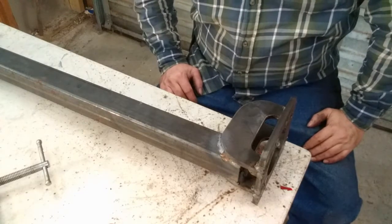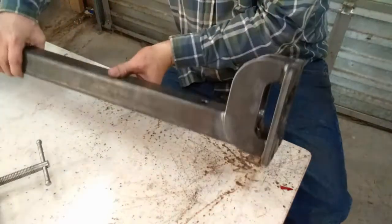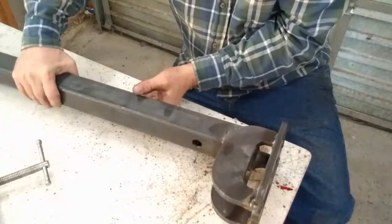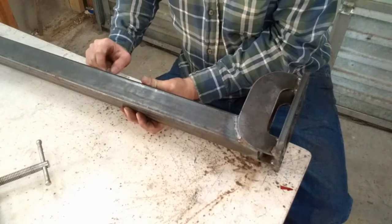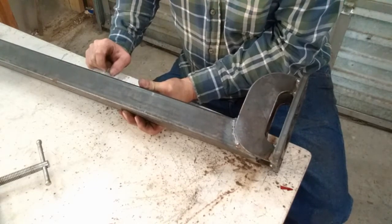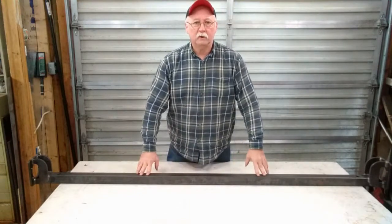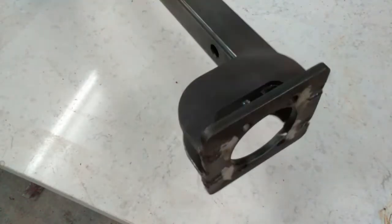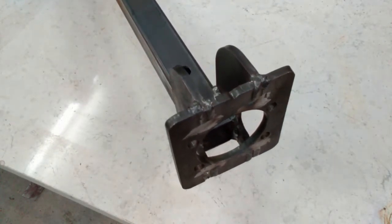You can see we've welded everywhere there's a joint — nice heavy fillet welds on all joints, both inside and outside. The bluing in the metal confirms a good hot weld that penetrated well into both pieces. Do the same on the other end and you'll have a complete axle. All that's left now is to paint it, put the bearing on the end, and you're ready for business. Thanks for watching.